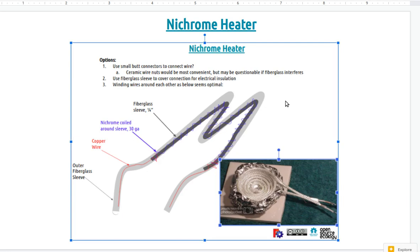They apparently use a 500 watt heated bed. I think it is 120 volts. But if you were to do that off 24 volts for 500 watts, that's 20 amps. At 12 volts, it would be pretty much impossible, at like 40 amps, that's quite a bit. But basically, now, instead of running that through the power supply, we get it off the mains power.